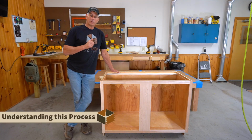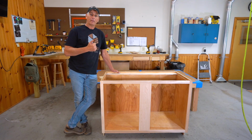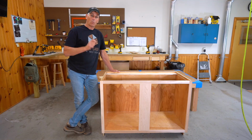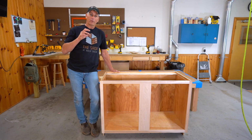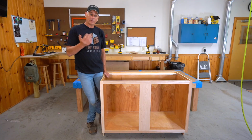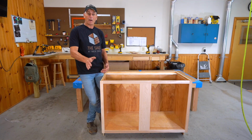So first of all, let's stress that these frames are not held on with mechanical fasteners like corrugated nails or something crazy like a lot of the stock box companies use. They use that plastic spline, that thin spline is what holds the frame to the box while the white wood glue sets up. And wood glue softens at about 150 degrees. There is logic that says if it's an unfinished cabinet like this, you could hold a heat gun on this until the glue warms up and hits that temperature, it'll soften and you can pop the frame off.